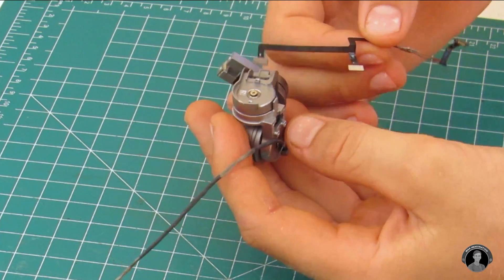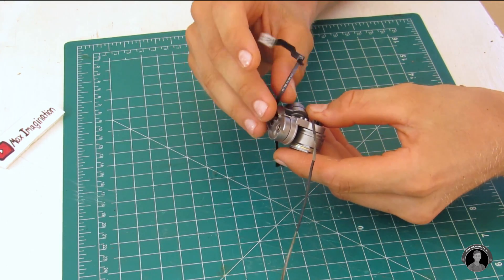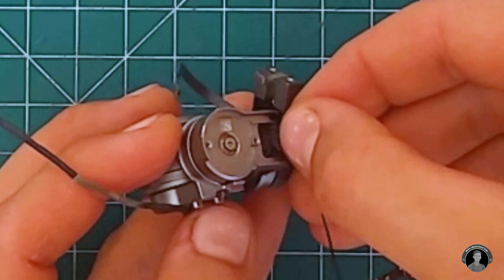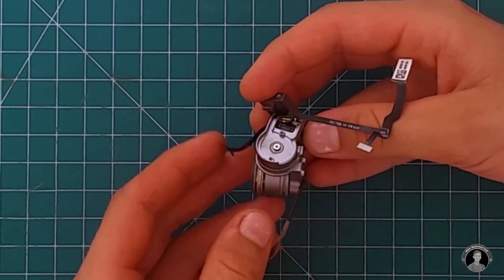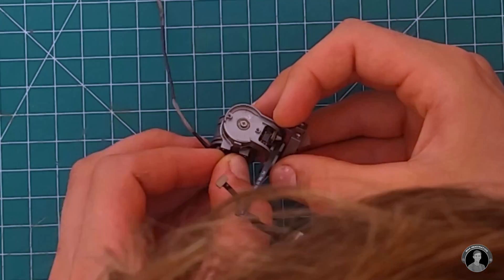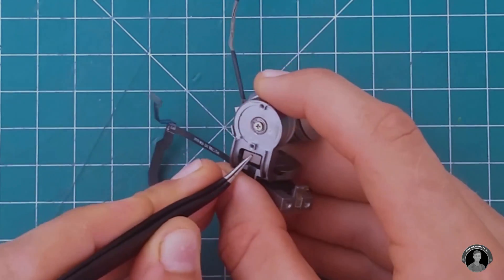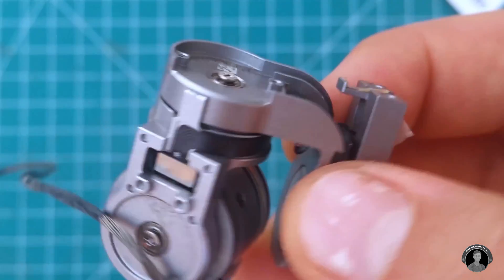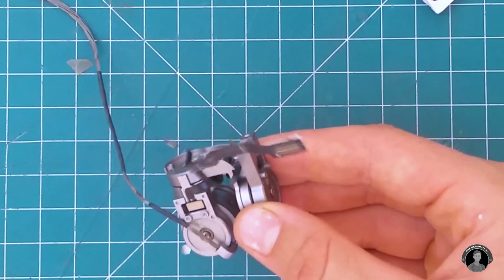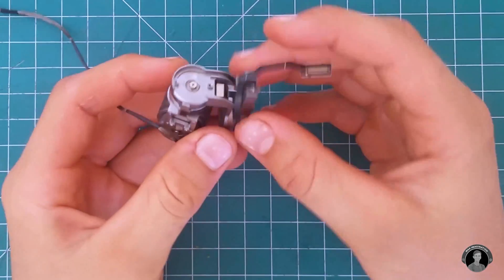Here comes the time to install the new cable. It's very important that you push the last of the small connectors through this little hole, then prepare the middle section's adhesive part, pushing it down further into the gimbal where it should rest. Make sure the midsection connector creates a U-shaped loop down in the gimbal — this can be seen from below. Once that part is seated in place, this connector here should stick forward and then be bent around forming a U-loop. It should go around appearing in the rear of the gimbal and connect to the roll motor. Press down a few times making sure each connector is seated in place. Peeling away the last adhesive section, curve and mount this intersective part onto the top of the gimbal — don't worry about this part overlapping as that is necessary. Make sure you connect up the pitch motor while pushing down really well, secure the piece of tape on, and gently press down on this overlapping intersecting part.